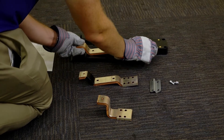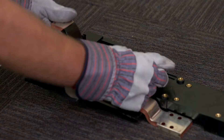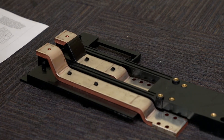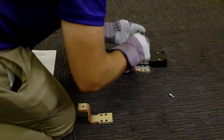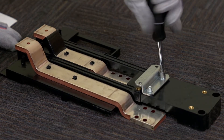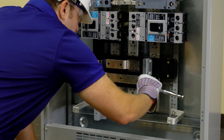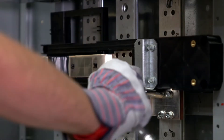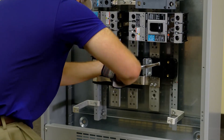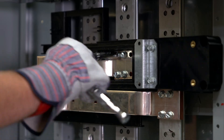Align the two square holes on the long phase strap and press down to latch the two snaps on the strap support barrier. Repeat this step for the medium phase connector barrier. To install the breaker mounting bracket, insert one screw through each hole in the breaker mounting bracket and tighten. Measure eight and three quarters of an inch of unit space in the board, then connect the Z rail to the support barrier with screws. Repeat this step and install the same size screw into each of the bottom holes of the support barrier.